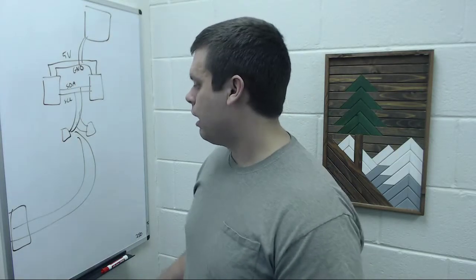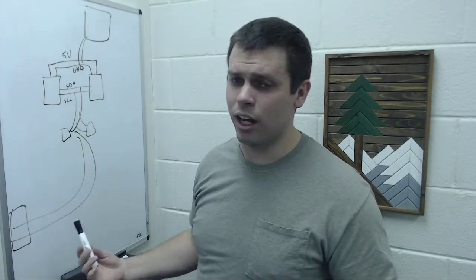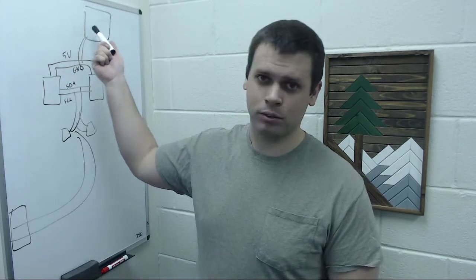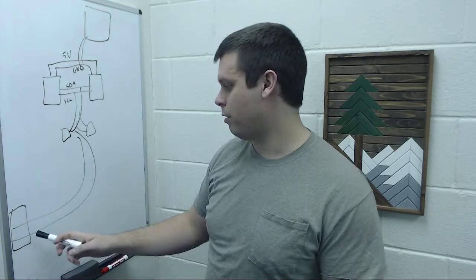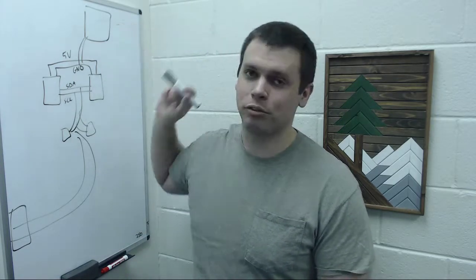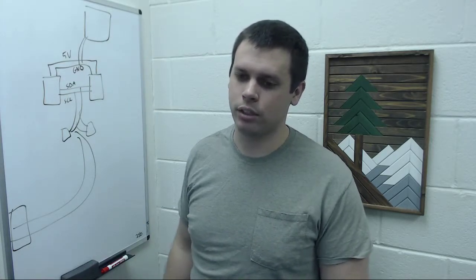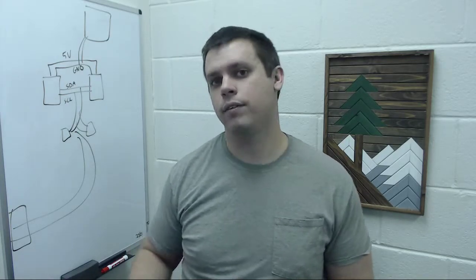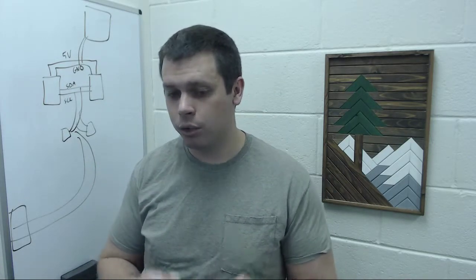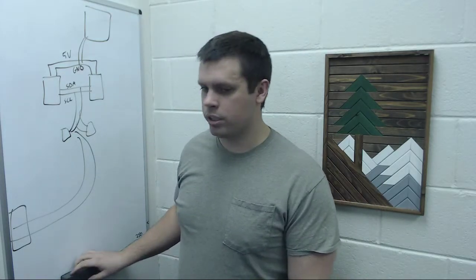I also had this problem of, we're using these NVIDIA Jetson boards. You plug them into I2C, and I still don't know what's happened to this day, but we've had like 4 or 5 boards in the past that just completely fry from something funky going on in the I2C bus. And then when that I2C bus would fry, the HDMI would stop working on the board. So the board would still turn on, it would connect to Wi-Fi if you had it configured to automatically connect. So you could SSH into it, but then the HDMI would just stop working. So I2C ended up being a flop.